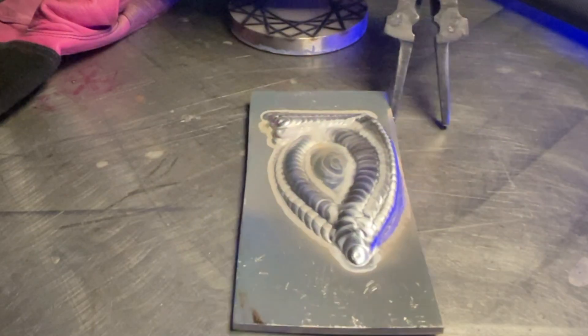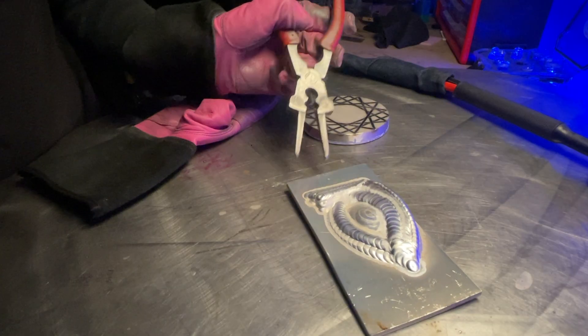As you can see, I'm slowly just building things up with different passes of filler material. Some areas I'm adding very little filler material, some areas a lot — again, this all goes by eyeball. I kind of switch it up as I go, put a little extra where I see it's needed. Deciding how to finish this pass out was a little tricky — I decided on doing a weave pattern. I switched from two steps to three steps, back to two steps, then finished with one step. This weave pattern to finish things up tied all the separate passes together nicely and kept good organization at the end.